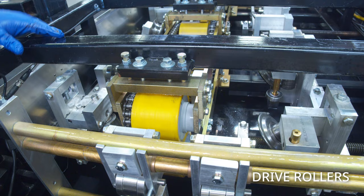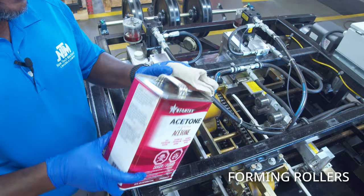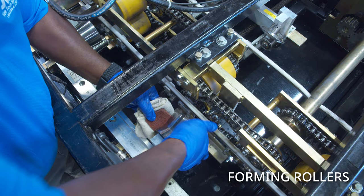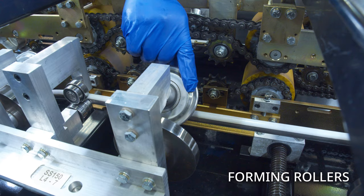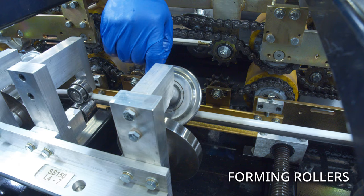Another product we use is acetone, which we use to clean the stainless steel forming rollers. Apply a little on a rag and spin the roller to clean it. Use a Scotch-Brite pad with acetone if needed — this prevents any buildup, especially if you run products that leave residue. Importantly, keep acetone away from the rubber bearing seals, as it will eat them up. Bearings with rubber seals are maintenance free.